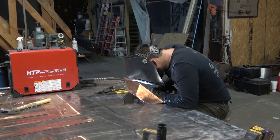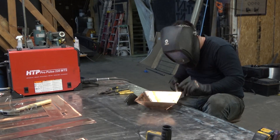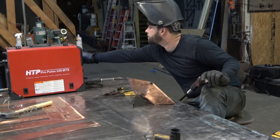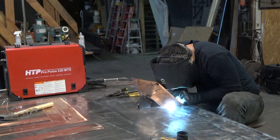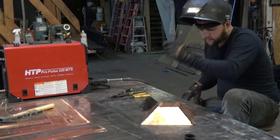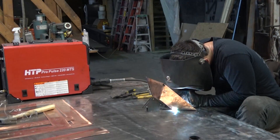After running these samples, I just did not like what inside corners looked like — I couldn't get a really nice clean weld on inside corners, and I was going to have a lot of them in this build. So as much as it hurt to do it, I decided I was going to go back and recut all the pieces as effectively stepped triangles that we'd then bend into shape for the final assembly.